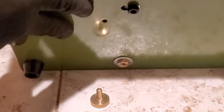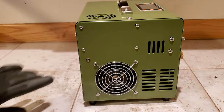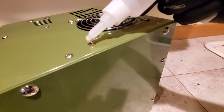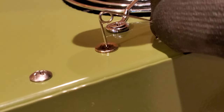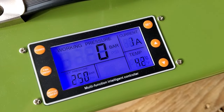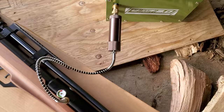Number four: locate the lubrication hole on the left side of the unit. Apply two to three drops of silicone oil every five fills or 1.5 hours of use, whichever comes first. You should only run this for five or ten minutes at a time. There's a temperature gauge on it, and mine actually turns the whole display red and shuts itself off when it hits 50 degrees Celsius.